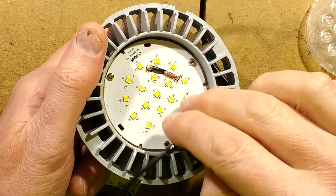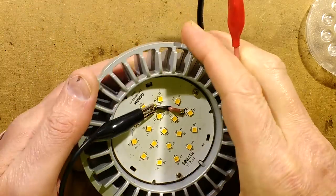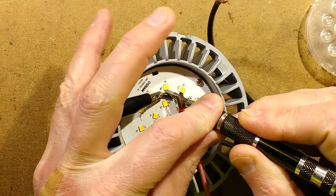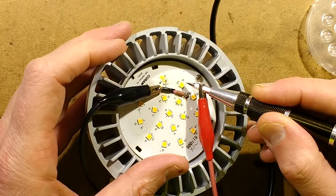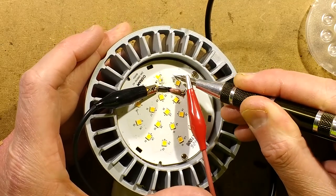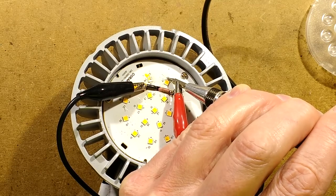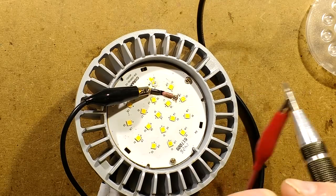So the black wire is going to this first LED — and yeah, that is the negative. Always worth double checking. I'll put this on the screwdriver and try to make a connection onto that end of the LED there. Oh, I've just pushed the LED right off. Well, that kind of messed that up. I wonder if it's still lit though — I don't think it would, given what I've just done to it. But you know what, let's give it a go anyway. I can see the track coming over here, so let's just scrub through the metal and make a connection and try to get this to light. It probably won't now because of what I've done. It's certainly not lighting at the 3V region. Even if it's two chips it should have lit by now — so either that was a dead LED or I've messed it up.